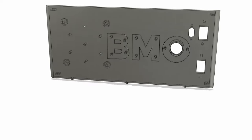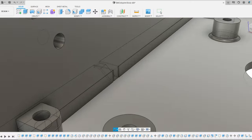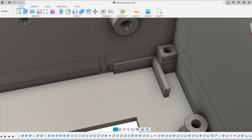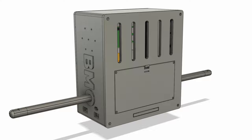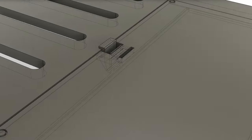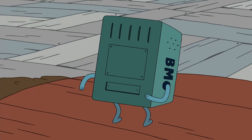What about BMO's side letters? I created them as separate pieces that are simple to print and will just press fit into the main body — no need for paint or a multi-material printer here. Supportless registration marks should make for easy alignment, and the walls all attach individually with M3 screws, making it pretty straightforward to remove pieces for maintenance or upgrades. Going around to the back, you can find one of my favorite design elements: the not remotely patented BMOctoprint butt flap, complete with butt latch for effortless access and storage of BMO's accessories.